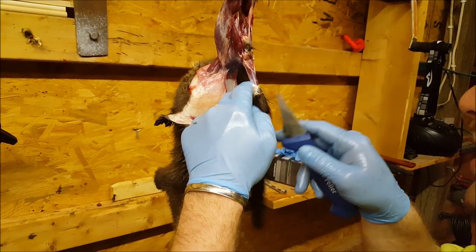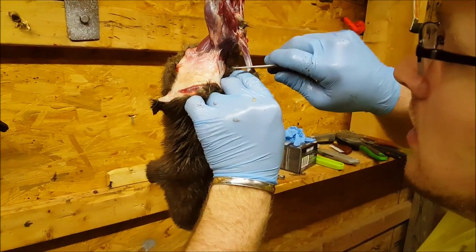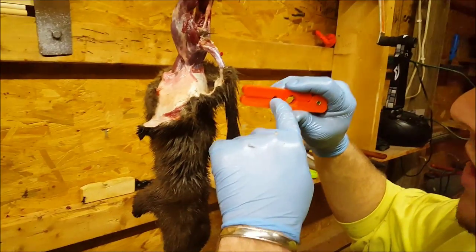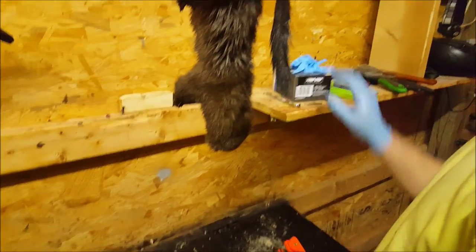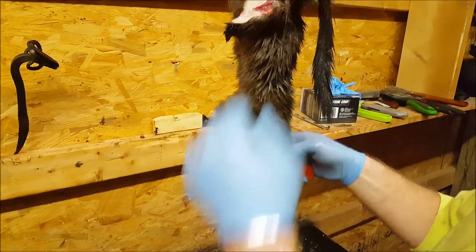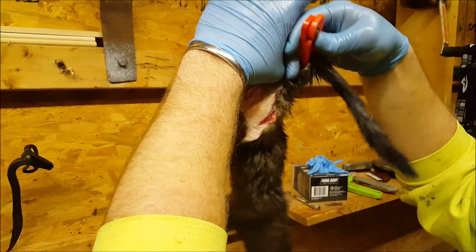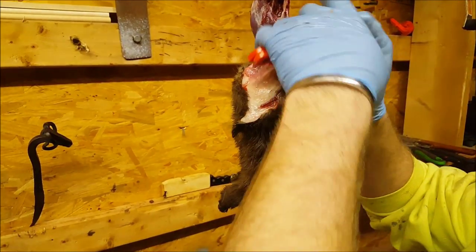I like to cut down a little bit. Alright, now we got it pulled down. Very, very long tail, so you want to be careful here on your tail strip. If you have a tail stripper like this, you're going to want to use your small hole. If you have the metal one that just has the one big hole, you're going to want to really tighten down on that thing. Put that up in there — especially on this one, you're going to want to almost leave this hand stationary and just pull up with your other hand.